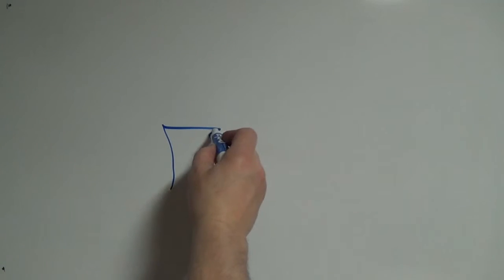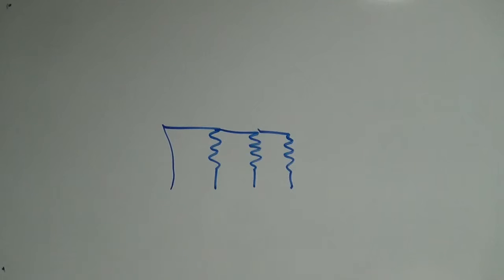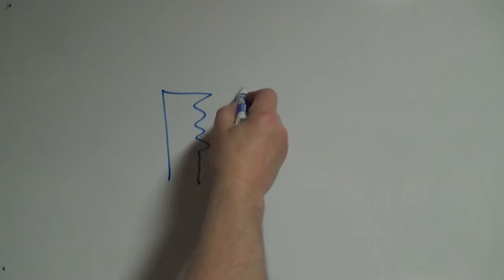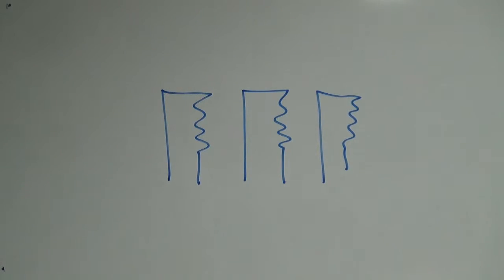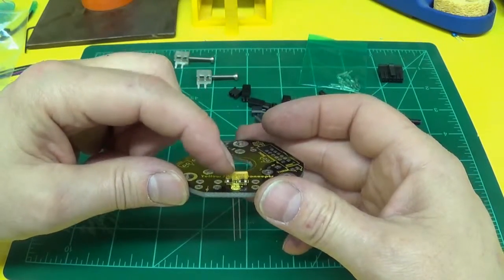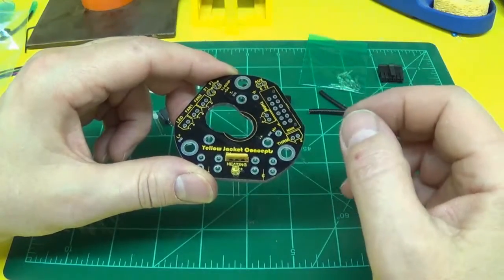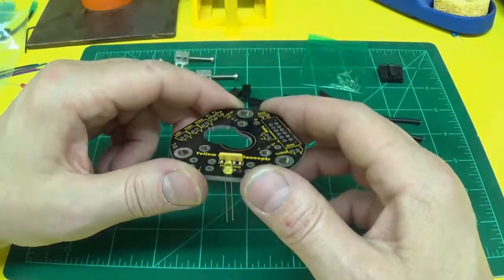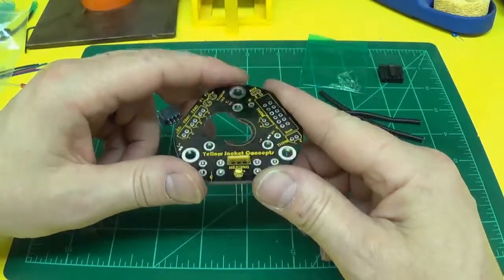A resistor array is a group of resistors that are all connected together by a common pin. A resistor network is a group of resistors all contained in the same package, but they are still independent of themselves. And that's a 4.7K resistor. It'll still allow enough current for your LEDs to be bright enough on 12 volt, and it'll keep the resistor from getting too hot if you're running 24 volt.